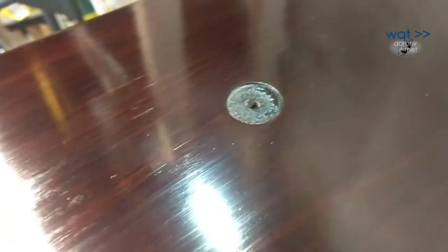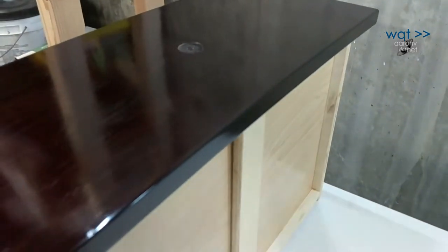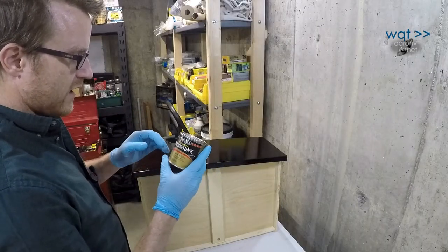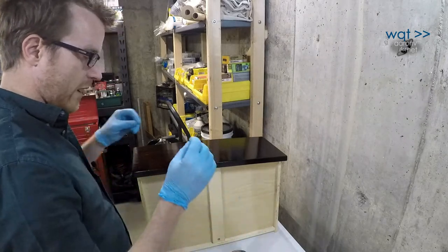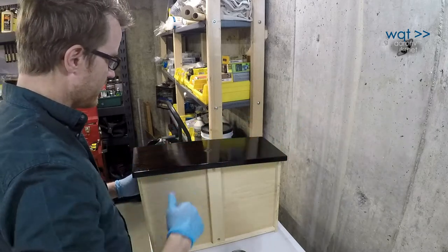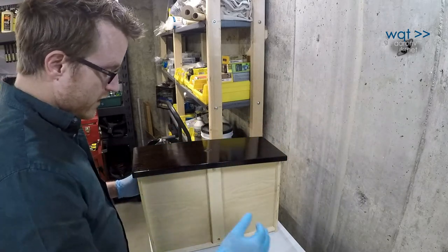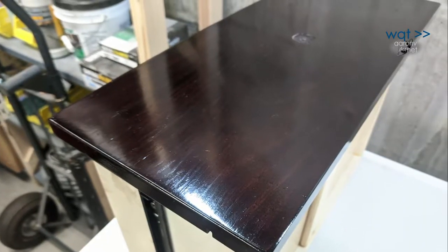And as a result, it has taken on kind of a thick, shiny sheen, even though this is in fact clear satin. The satin polyurethanes contain some sort of disruptor that when it cures, it forms like a really microscopic level crackle or orange peel, which is why it takes on that matte finish and doesn't reflect. And when you thin it and then apply it thick, especially on the first coat, it seems to kind of disrupt that, and it's sort of glossy.